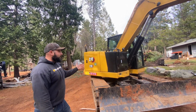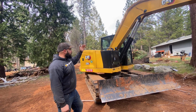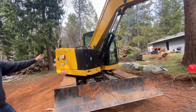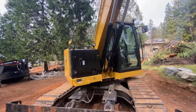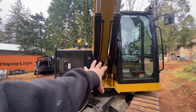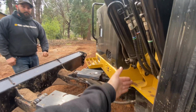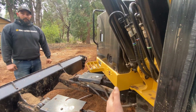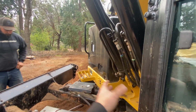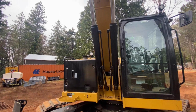Yeah. With the 309, you still get a swivel boom. This one completely removes that, and now you have a twin cylinder, stationary stick. You just get way more lifting power. That puts the hinge point farther back in the machine, versus what he's talking about, which is like what a backhoe has. It's got an articulation right here, which a 308 and a 309 and pretty much every excavator close to this class would have. But this one's actually a legit excavator tucked in there.